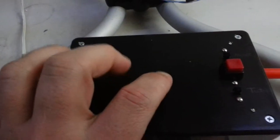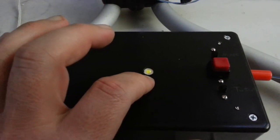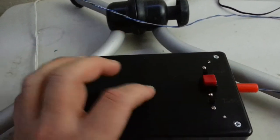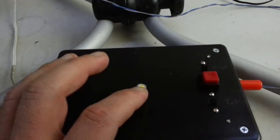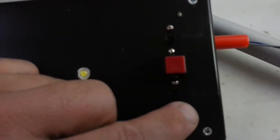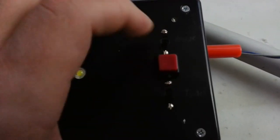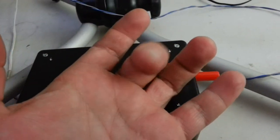Here is the light just to indicate that a response has been made, perhaps to a question or following a chart, or that the user is trying to get some help. So the finger would just be twitched down or pulled down, and then this light would go off for a second, just basically flash real quick to get somebody's attention, to indicate a yes, or to indicate, hey, I'm trying to get your attention. These switches right here change the rate at which... this one right here is the twitch on the bottom. It indicates which position the twitch delay is in, and then this switch indicates, depending upon where it's at, how far you actually have to move the sensor before it activates the switch.